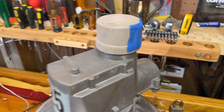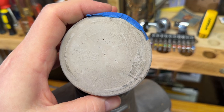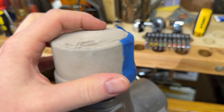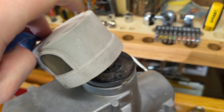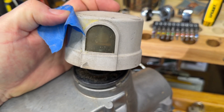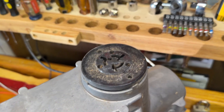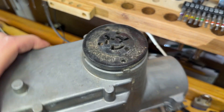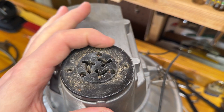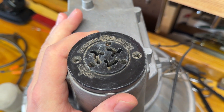Now let's take a closer look at the fixture itself. We'll start at the top here with the photo cell because I do believe it is original. All these date codes seem to match up. We do have an 07 on the bottom of it here. It's a Fisher Pierce. I do have the front covered — it is quite yellowed. But even though it is old, it still functions. I'm surprised, because usually you find older photo cells like this and they're already day-burning. Underneath, we have the photo cell socket itself. It does say General Electric on it.